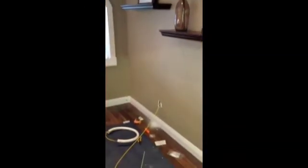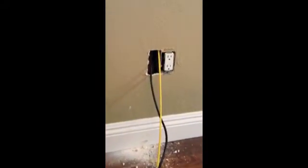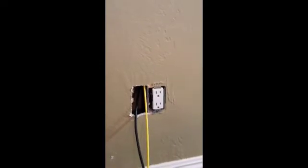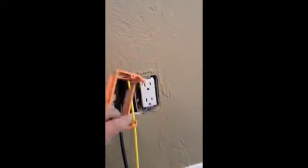I am fishing the wire for our subwoofer, which is going to go in the corner. We're using standard RG6 coaxial wire, and we're going to trim it with a standard coax wall plate, then use an F-connector to RCA adapter wire from the wall plate. That'll make sure it doesn't get knocked off the plate when we're moving the couch for cleaning. It'll just make it into a standard double gang ring.